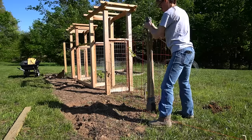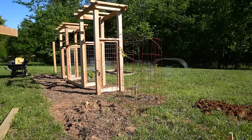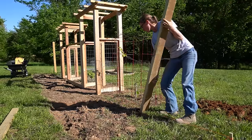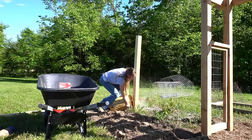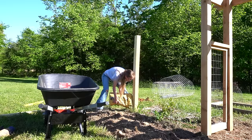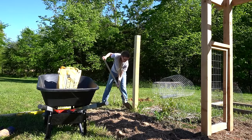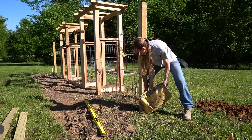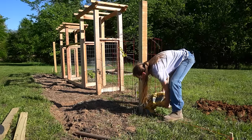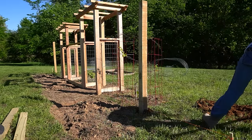I dug these 24 inches deep and I hate digging post holes — I'm very slow at it, so I didn't waste room on my SD card to film the whole process. I cut my 4x4 posts to 7 foot long so they would go into the ground about 2 feet and stick out 5 feet, and I used concrete to set the posts. I made sure they were plumb vertically before adding too much concrete so I could adjust if needed. I used treated wood for the fence framing because it's way cheaper than cedar — I just used cedar for the arbors.